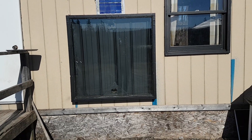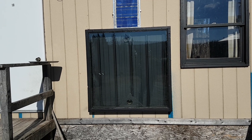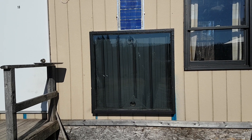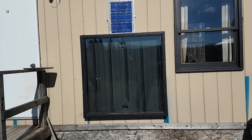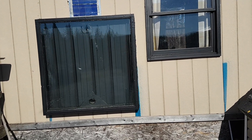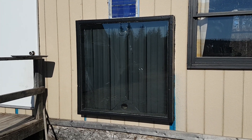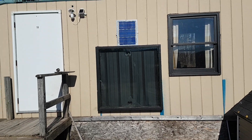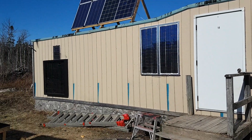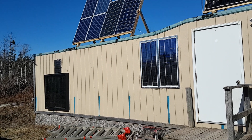After sealing, I sprayed the whole chamber flat black paint. Then I put reclaimed roofing — leftover cutoffs from a roofing job. It's only tin, not aluminum. After that was put on, it was also spray painted black. Then when the glass was put on, the whole unit was caulked so it was fully sealed. There are two of these units and the size was based off the windows I had.